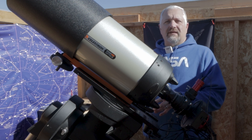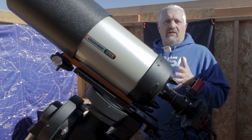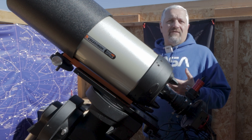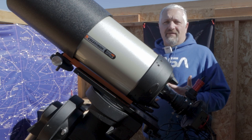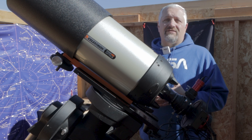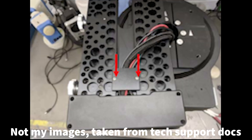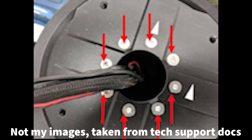It was really cool that I got to do this in a way, and of course in another way it's not, because most people order something brand new including myself and you just want a really good working mount. You don't want to have to start tinkering with it or tearing it apart. I kind of enjoy this type of thing, so to me it wasn't the end of the world, but I could see where a lot of people would have issues with doing what I had to do. The first thing I did was remove the Losmandy dovetail mounting plate, and after that I removed the electronics that go with it — that was only because the through-the-mount cabling was connected in and I just wanted to hang off the box. I didn't want all the weight from the whole plate weighing down on those cables, so I left the cables connected and worked around them.